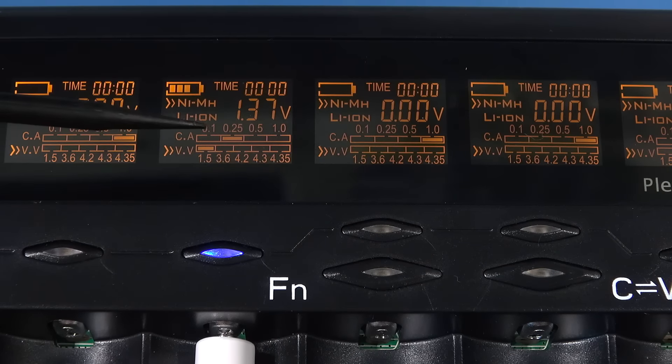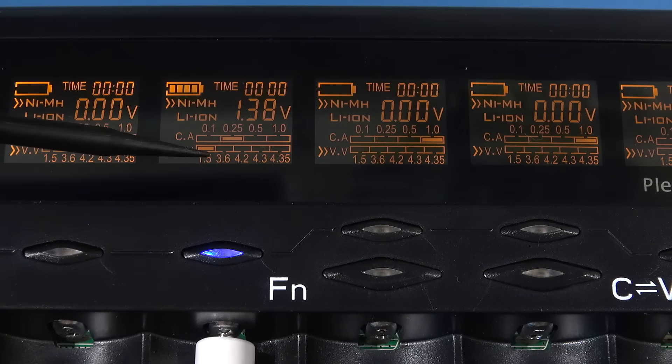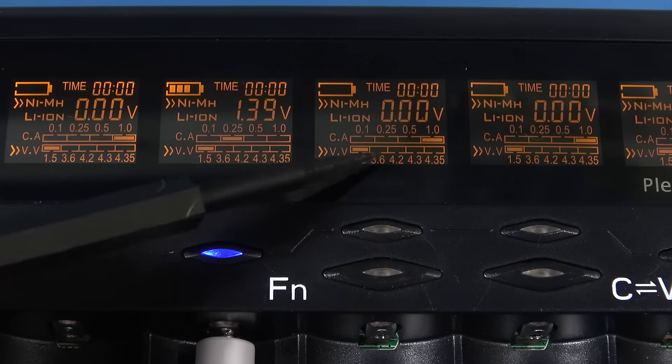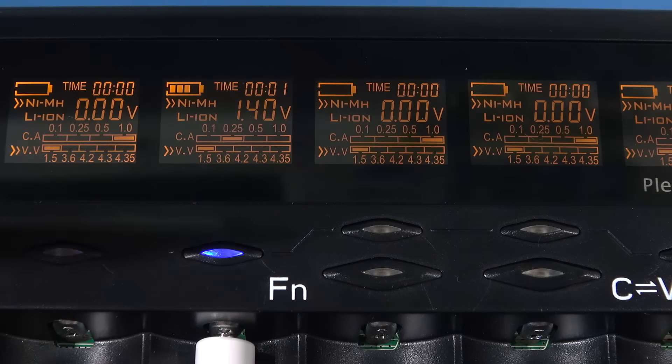The charge level behavior depends on the voltage. If the voltage is below 0.6 volts it won't charge, and below 0.5 volts it won't even register a cell. The cell needs to be at least 0.5 volts. At 0.6 volts or higher it starts charging at a lower current than specified. It only ramps up to the specified charge current once it surpasses a certain voltage - for lithium around 4.2 volts, once past approximately 3 volts it kicks up to full current. When charging completes, the indicator light turns red.